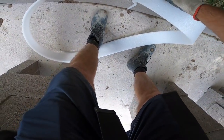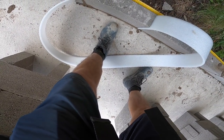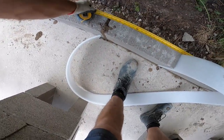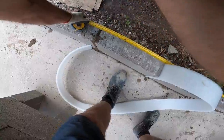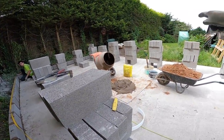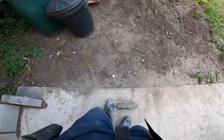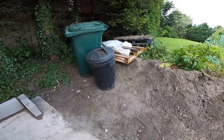So 6540 works block. Half to a block. 6540 is there, so we tighten up because we've got big cross joints here. So we start with a half. 6540. There. So we can tighten that up easy. So we start with a half at that door to a full one at that door. Okay. Always scrub out your old marks so you don't get confused by them. Easily done.